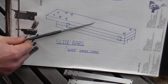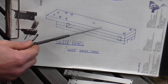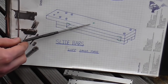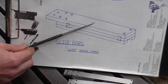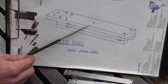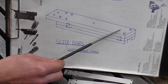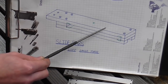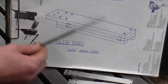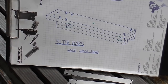I'm going to be putting in the oiling holes. This drawing actually shows just one oil hole but I don't think that's particularly suitable because a lot of the sliding surfaces are at the edges and one oil hole in the middle isn't going to reach them. So I have redesigned the oiling system — you'll see more of that when I get to making the cross heads — but for now I'm going to put two oil holes in, tapped to accept some kind of cup or oil can adapter. Also I've studied the support mechanism and I'm going to be pushing four tapped holes in towards this end to accept that support so that when I eventually get there I'm not having to start drilling and tapping into what could be a finished piece.